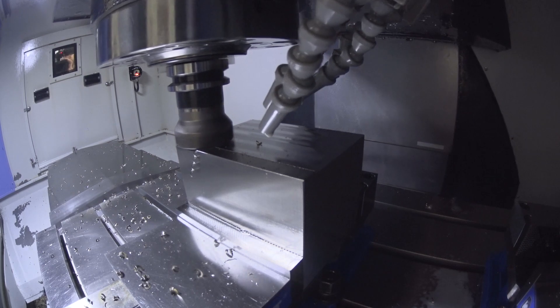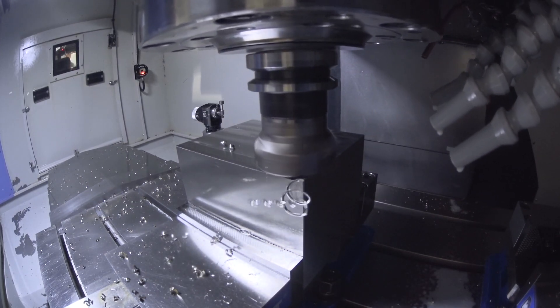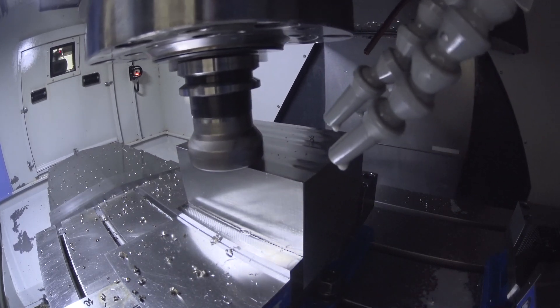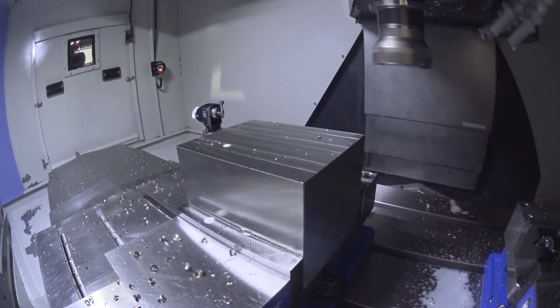And like you say, thin components where the cutting forces are far kinder on a near 90 degree tool, but you've also got the insert economy and various ranges as well. Yeah, we've got two different geometries, a couple of different grades available, we've got wipers on the insert, we've got corner radiuses on the insert, and this is a tool that's sort of growing in use.